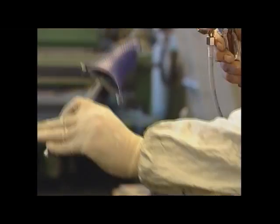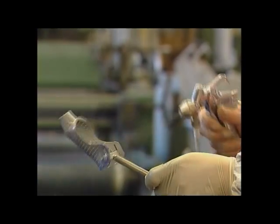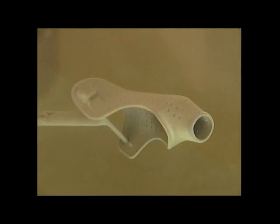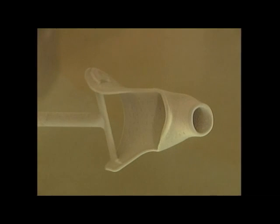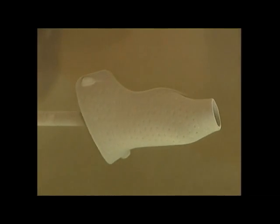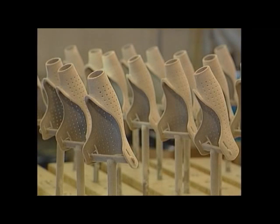A water-soluble dispersion adhesive is applied with a spray gun onto the fluorized PE part. Apart from an even adhesive coat, the flock also has to be applied evenly in the electrostatic field — only this guarantees a good flocking. Depending on the geometry of the formed parts, it is additionally recommended to use auxiliary electrodes or a pneumatic support system.